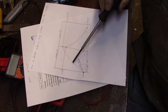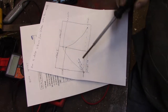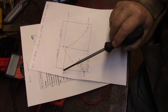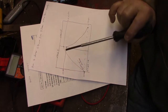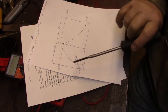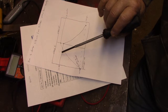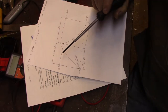So when you start to charge it, it'll start to ramp up until, this is time. Your charger will be charging at 1.5 amps. That's stipulated in here. If we're going this way, we'll say minutes. As your voltage is going up, you're sticking at 1.5 amp. That's your maximum amperage, the maximum amount you can put in the battery safely without heating it.